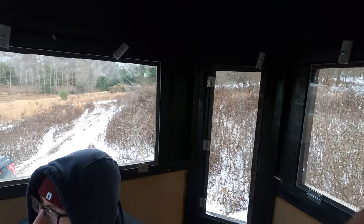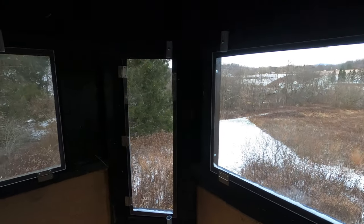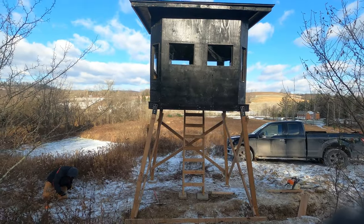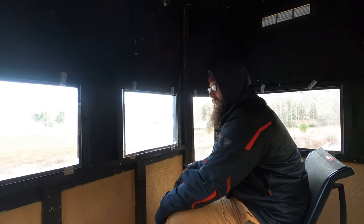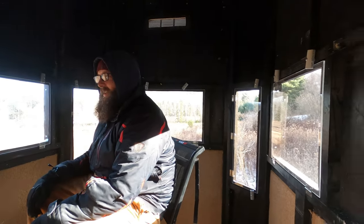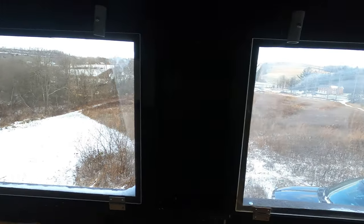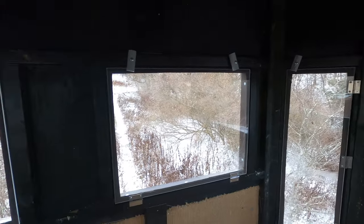I'll conclude with some final shots of the 360-degree views from the blind while I share some closing thoughts. Overall I'm quite happy with it — it's certainly more comfortable than the ground blinds we've been using, and we did manage to take one deer from it in the first year. I originally decided to build a 6x8 blind to accommodate two hunters, but in practice we tended to hunt solo, so if I build another blind I'll go a little smaller. I like the octagon design, but I think maybe 5x5 is a decent size for a solo hunter. Also, I set the window height based on Brett Moravitz's design, and at 6'4" I found the windows on the uphill side were a little low — I may come back and shift those back windows up a couple of inches next year. If you're interested in the details, check out the links in the video description, and thanks for watching.